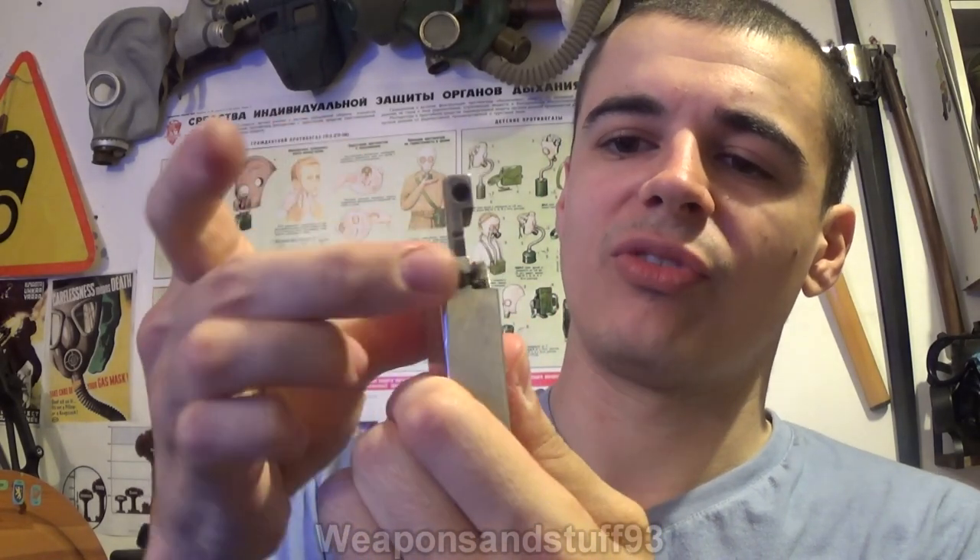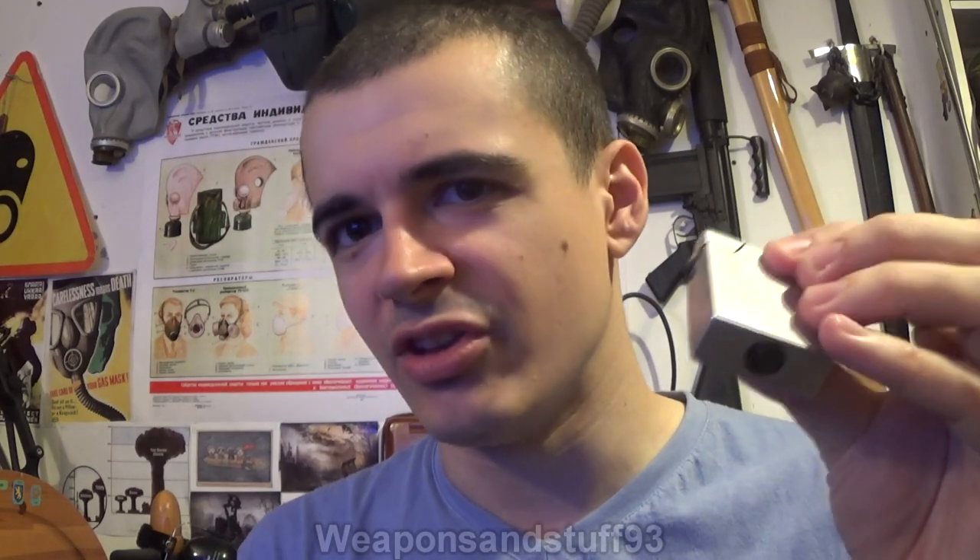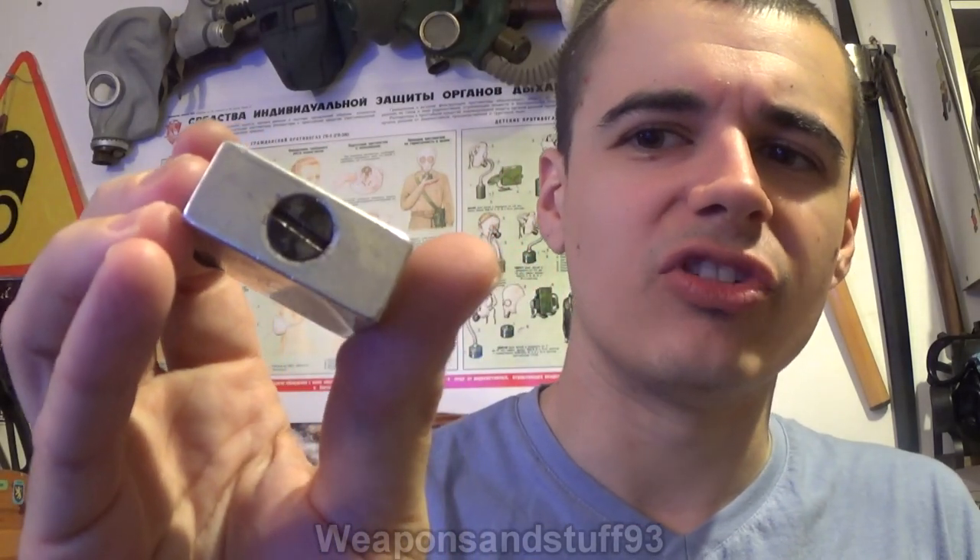I think I'm going to have to re-sort this wick out, because I think the wick solution I've done is not ideal. Probably with some tweezers I can pull that wick out a bit more, but that will be a subject for another day. Anyway, it's a lovely little lighter. I hope the people who like lighter videos appreciate this, because it is unusual. It took me about an hour to fix all the bits in it. Again, if I had to do another one of these, I could do it much faster because I'd know exactly which bits I'd have to do. So yeah, it's still a work in progress. I might need to get a few more sparks coming off that flint wheel, re-sort out the wick, and potentially look into putting a new washer under that screw, just so no fuel evaporates quickly. Otherwise, a very nice little old lighter — lovely to get old lighters like this, because they are a bit of a gem.